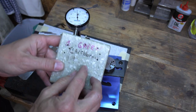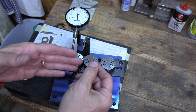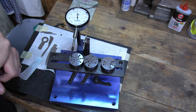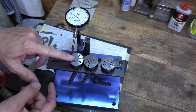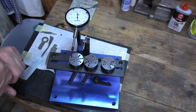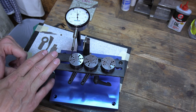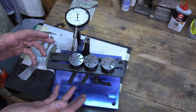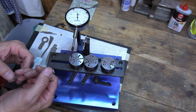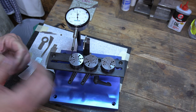The way I started out was just with a board with some holes in it — you use your liners, set your holes, draw a line across the back, open and close the blade, and see where your spring is in relationship to the line. A step up from that would be the Ruple jig or rise/fall indicator using a dial indicator to measure the distance the spring is traveling. A further step up is this Kennedy fixture, which has built-in support for putting your spring under load — something traditional rise/fall indicators don't offer.